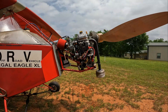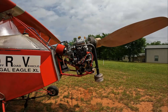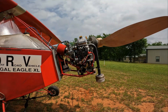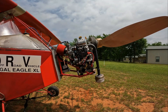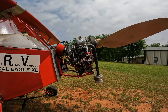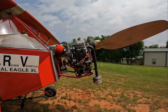Now that's a half VW depending on how you treat your half VW. If you have an automotive electrical system with a very heavy battery, it may be more than that. If you have a magneto, it will definitely be more — the magneto by itself weighs four and a half pounds, plus the connection inside the engine. So we're good weight-wise compared to the half VW.